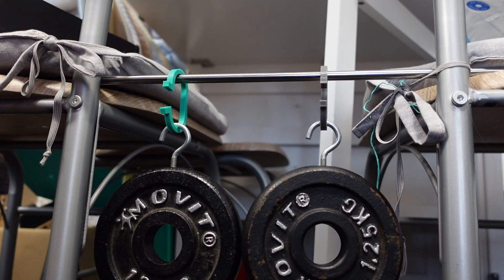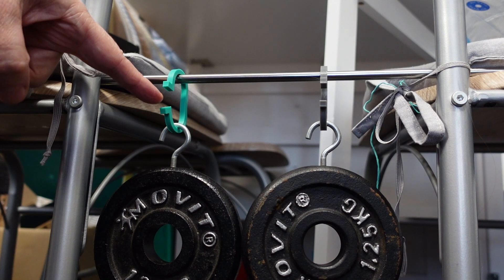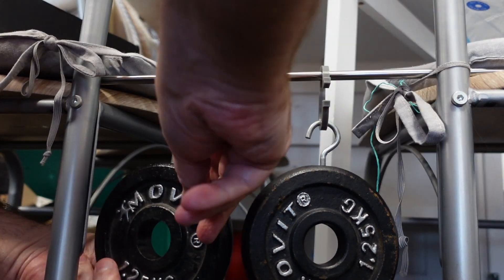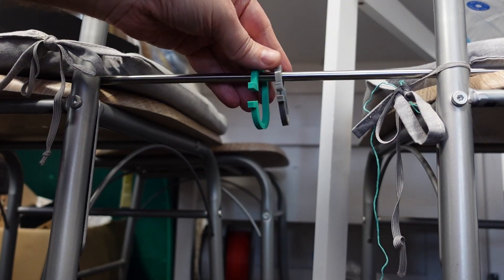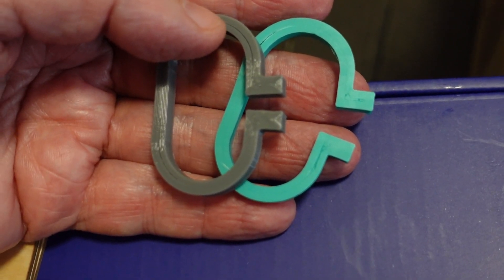On the last — fifth — day, even with the bare eyes I can see more deformation on the PLA+ part compared to the PETG. After removing the load, approximately 5 minutes later there is more permanent deformation on the PLA+ part compared to the PETG.